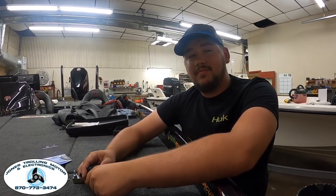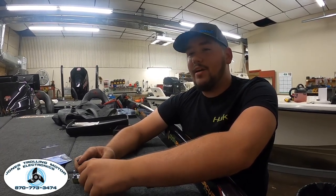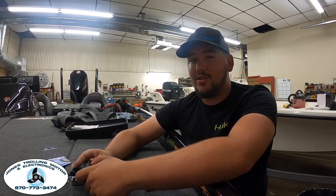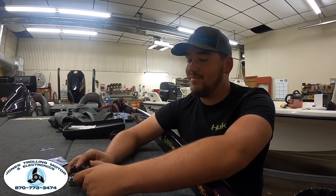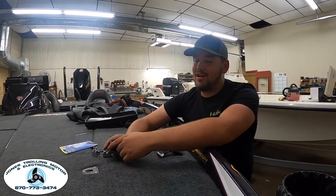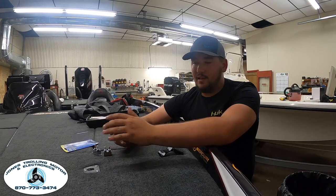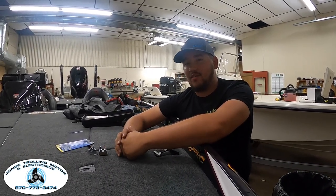Do you leave your trolling motor charger on all the time? If it's going to be over a week or two, I do not. Minn Kota's precision chargers are very good about going into a float mode and maintaining, but with any other brand of charger I don't trust the science behind it — I've seen too many problems over the years. I've left my Minn Kota precision plugged up for a couple of weeks and come back with batteries plenty strong. But what I try to do after a long period like that is unplug it the night before, let all the lights go off, let it reset, and then hook it back up — that way it restarts its cycle and everything's for sure topped off and you're ready to go the next day.